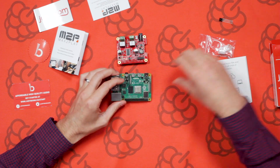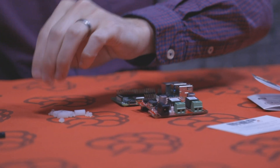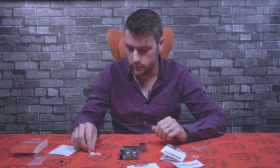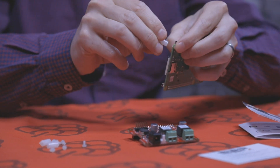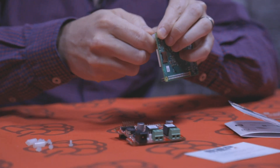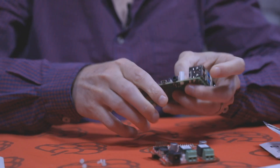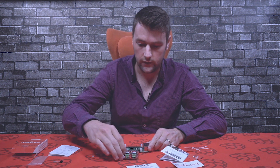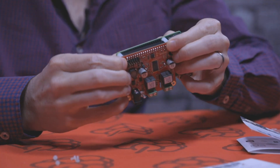So let's assemble it to the Raspberry Pi — I've got a Pi 4 here. First I'm going to screw the standoffs to the Pi board; it's a lot easier to do it this way. You should be able to do this with your hands and tighten it up after. Just slot the screw through and screw the nylon standoff on. Once we've got those on, we just need to add the AMP HAT — slot it over the GPIO header and push it down firmly all the way.